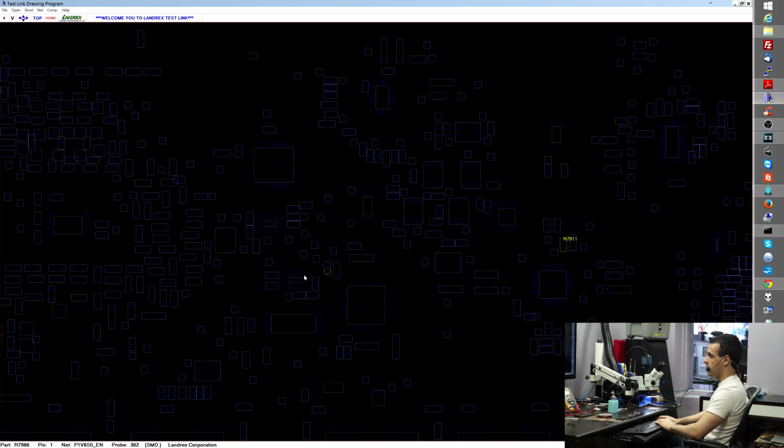Here we go. So right over here where P1V8SOEN is, that is created from PM sleep S3RL, and this pad over here was gone, and that area looked terrible. So I kept scraping and scraping away, and eventually I saw that there was a very, very small little piece of copper that I could solder it to. And when I did that, the board turned on and worked.